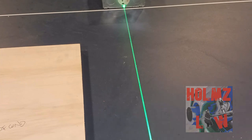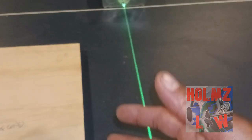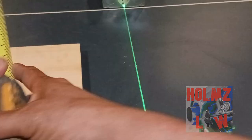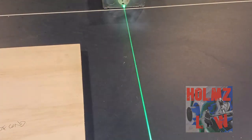That's taking measurements from the floor for your ceiling runs. Usually that's something you do with larger conduits or when you have no reference at all up in the ceiling. What you'll do is mark the marks on the floor like we just did and measure that way. All you're really doing is simulating the offset on the floor — transferring the conduit that's in the ceiling to the floor and bringing your target to the floor, then just taking the measurement that way.